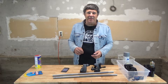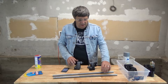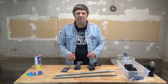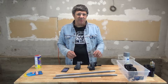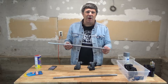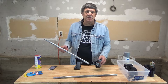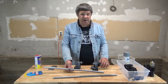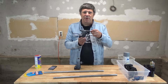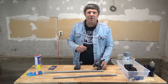It looks and works kind of like a lathe. It's just two end pieces mounted on a pair of pipes that can be adjusted to accommodate the length of the cylinder you want to paint. This jig was designed so that you can swap out the rails to whatever length you want, so your jig only has to be as long as you need it for the pipes and cylinders you need to paint. On one end there's a handle so that you can rotate the cylinder in the jig while you apply spray from the can with your other hand. Let me show you how it works.